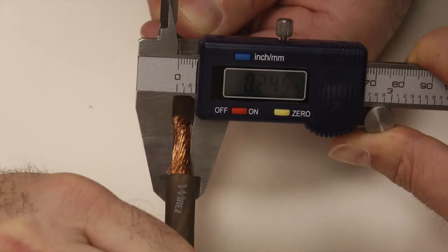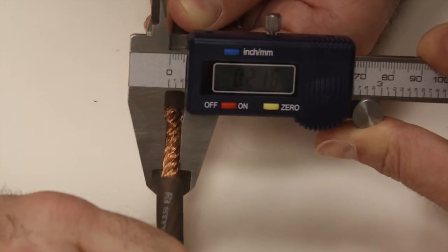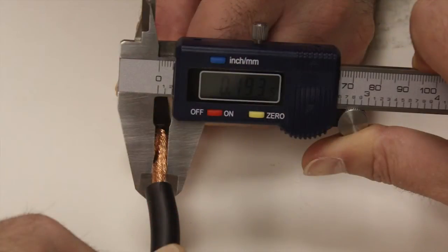In another video we're going to compare the interconnects. When you go shopping you have to wonder why one TV or one computer costs more than another — ultimately it comes down to what you get for what you pay. In the case of these amp kits, the first thing we decided to compare was the area of the conductor inside the power wire. We expected that at least one of the kits would be similar to the WIRES TEC series kit, and in fact the PowerPro kit wasn't too bad — it has 94.4% of the conductor area. However, things got quickly worse from there. The iConnex, DB-Link, and F3 Street kits are about 80% of the conductor area, and the Q-Power is 68%.